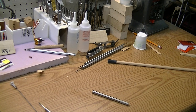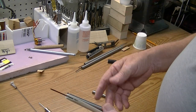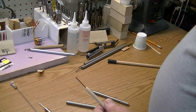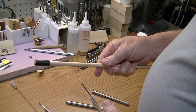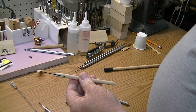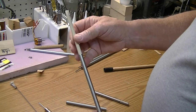The only hang up with stainless steel is that the only way to cut it is with a Dremel tool. Now, if you use brass, you can cut that with a simple hacksaw — or actually you can cut brass with your hobby saw. Then you want to find a piece of tubing that will go over top of a dowel in the size that you want to use. Usually I think that's about a 5/16ths there. Basically you have to get the dowel to fit the tubing that you've got.